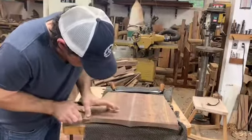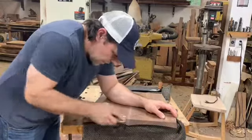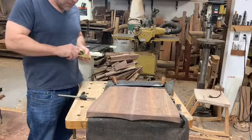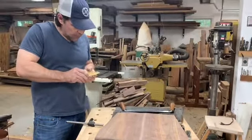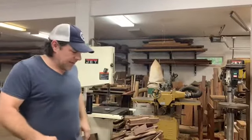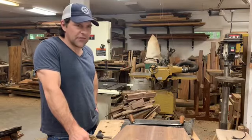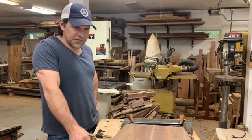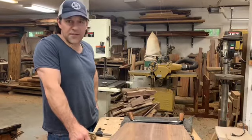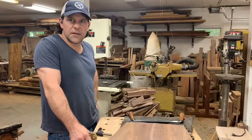Talking about attaching the seat to the base, you had been talking about making brass holders. Yeah, I was talking about fabricating some flat brass stock that would be mortised into the rails of the frame of the rocking chair. Then the other night I had it put together and I realized it's not necessary. I'd already built in a place to fasten it with the top rails that would be totally sufficient, and there wouldn't be the extra work of making the brass. Even though they're really cool, they're not necessary for this. Would it be overdone? Overdone, and it's just not necessary.